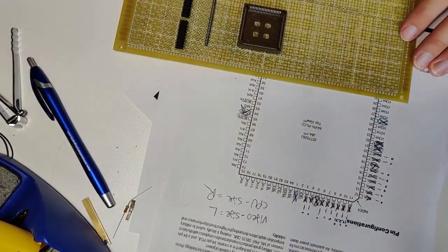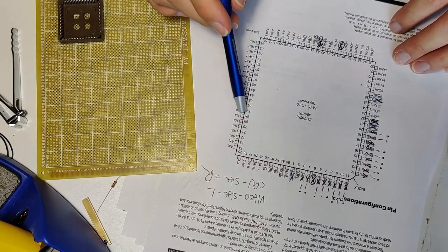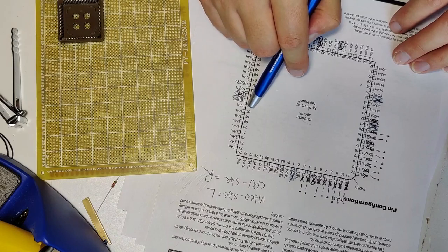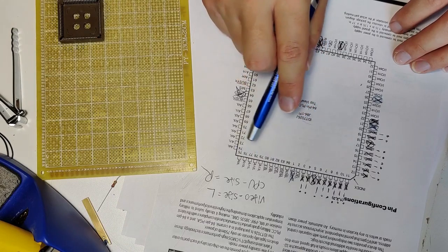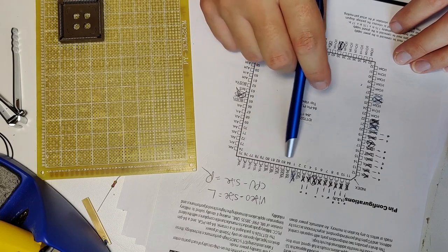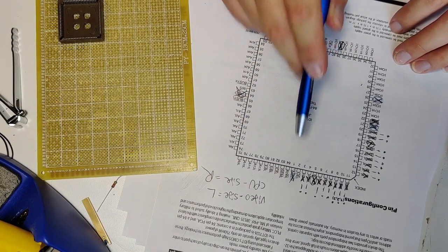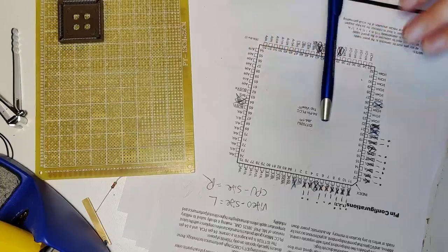I guess the next step is there are all of these controls. I will also want to bust the address pins out. It looks like they go from here to here, and I will put them all on headers for now, for sure, because whatever I'm going to use to drive this chip, even if I'm just grounding or lifting these to power to set a fixed address for a while, I'm going to need to adjust that and then be able to unplug my test harness. So we're going to bust out everything from here through here and just put it on a header. Maybe I'll start with the address stuff and then do a separate header for the bus control. And then we're done with half the chip, so that's something. All right, let's hit it.